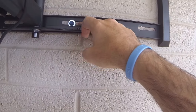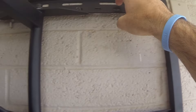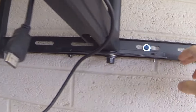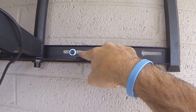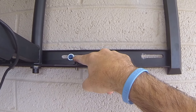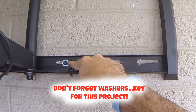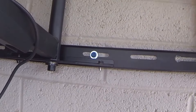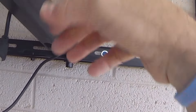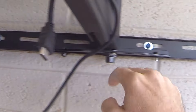These slots — I marked this wall. I put the mount up here at the height I wanted and did pencil marks all along here. You can see I got not only the Tapcon screws but also washers, because the Tapcon screw alone would barely hold the mount on. I wanted a firmer hold. You'll also notice where I put them — they're not lined up vertically, but horizontally they are, because I wanted to be at the end of blocks.